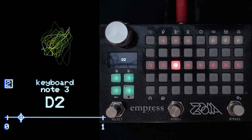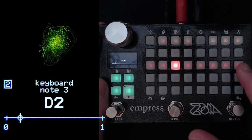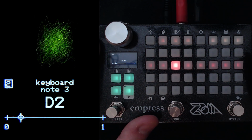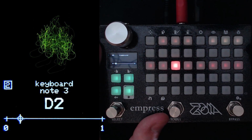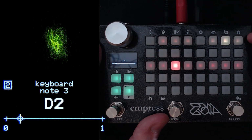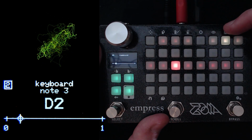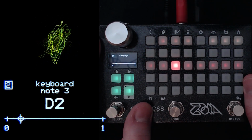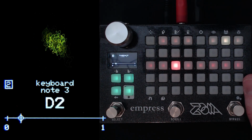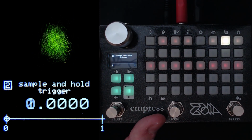So there we have it. That's quite a nice, simple way of cleaning up a transposition signal, which can come from anything, and then synchronize it with the gate of where you want it to go. 2 sample and hold modules is all you need for any kind of signal to be transported somewhere else at a certain point.